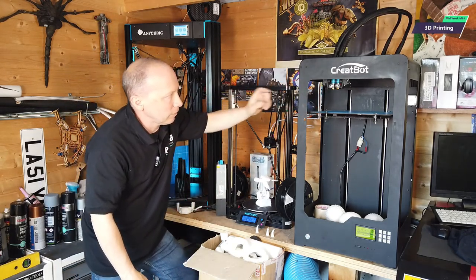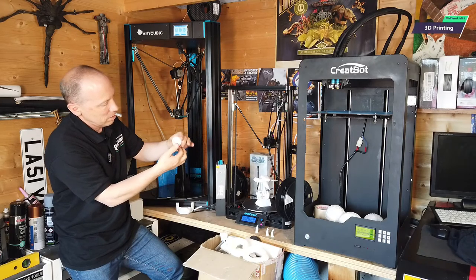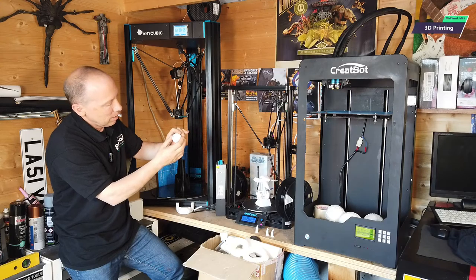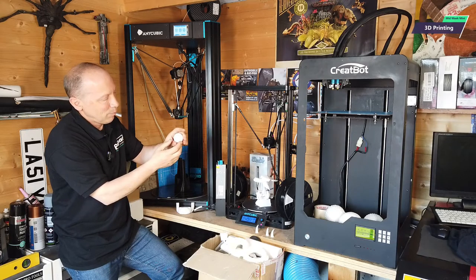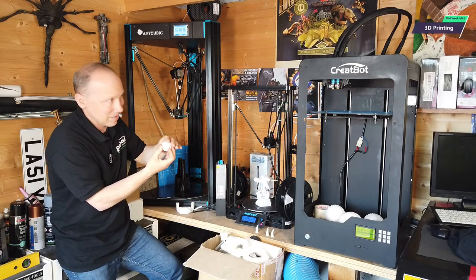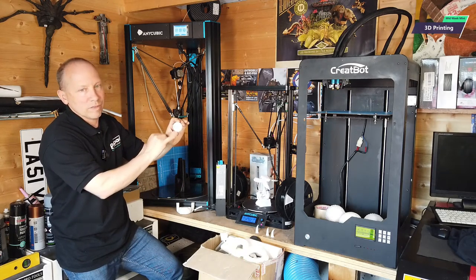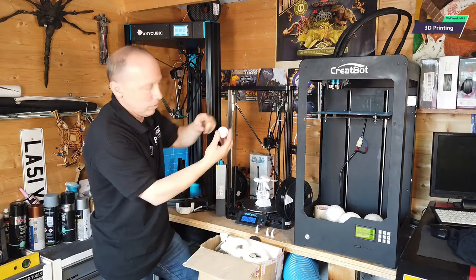This commercial printer was useful in that you can print with different colours. Or — here in my magic box of tricks — I've printed this sphere. It failed, but inside it has a support material. It needs a support material because when you print something, it can't print in mid-air — it's got to stick to something. If you print the support material with the same material as your print, it can be problematic sometimes. But if you have a dual-head machine, you could print with PLA for the outside and PVA on the inside. PVA is water-soluble — you take your print, stick it in a bucket of water for a couple of days, and when you come back, all your support material has melted away. So you have a perfect print. You can do that with dual-head machines, and you can also print with different colours.